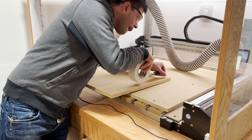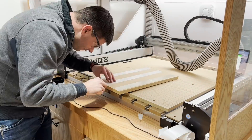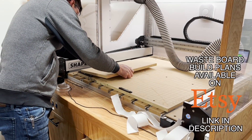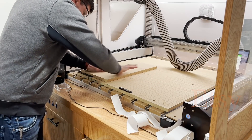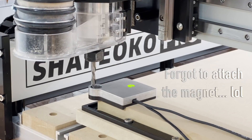My stock material is going to be three-quarter inch MDF — cheap, super easy to machine, and I'm not too worried about using a fancy hardwood for this. Work holding is double-sided tape and that worked just fine. I use a bit zero and absolutely love it, but it helps if you use it properly.